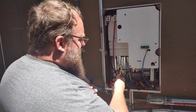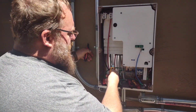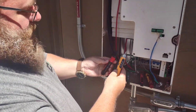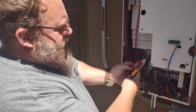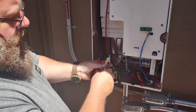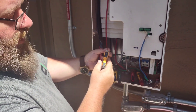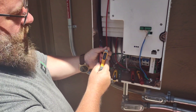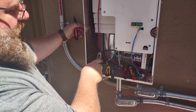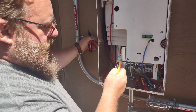Now here's one I really do like — the Ideal version. These are great meters. They have really nice loud alarms, big green lights, and flashlights so I can see inside. The problem with this particular one compared to the Milwaukee — my tried and true — is the tip is twice the size, making it hard to get into tight areas. We also want to always make sure it has a small round tip we can stick inside an outlet to test from hot to neutral. When I put it up against the hot side it goes off; against the neutral it stays green, meaning no power. That's really important.